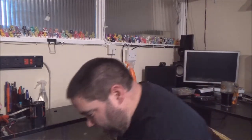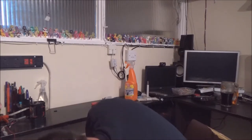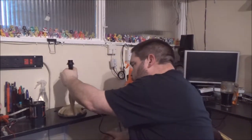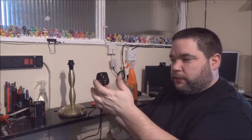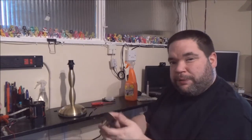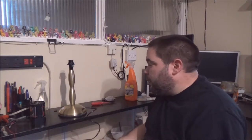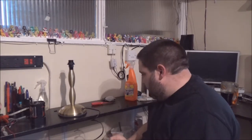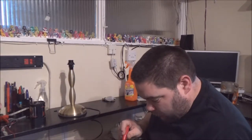See if I can get Mum to get LED bulbs for these — they're all exactly the same. If I had the little PAT test machine, I would plug it in. All that machine will basically do is just make sure there's no shorts between live and earth, neutral and earth, and neutral and live — just make sure that there's no leakage. I could do it the hard way with a multimeter. This one doesn't have a sticker over the screws, so I am going to check this one.